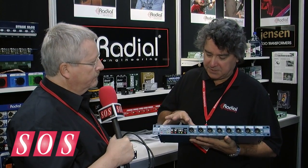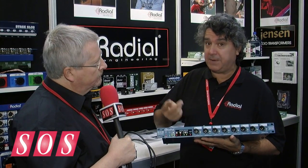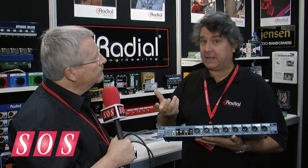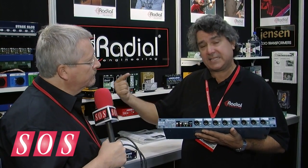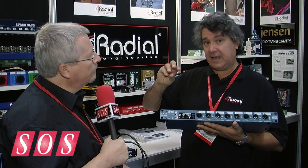What bands do is they pick up these SW8s, which allow two playback systems to be used simultaneously. Should a problem occur, one will automatically switch to the other — done either manually or with a gate. A gate means you can have a test tone, such as a 1 kHz tone going into the box, and if that tone shuts off, the SW8 will recognize the problem and switch across.